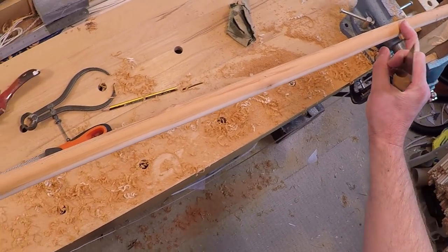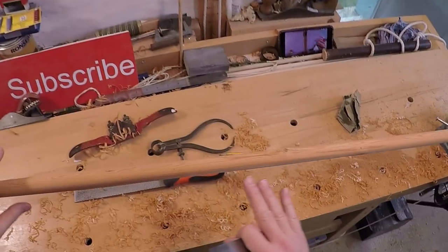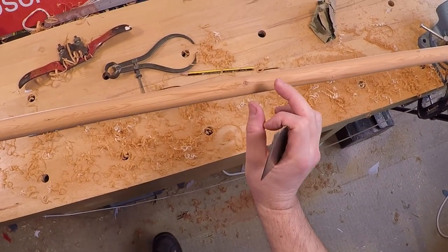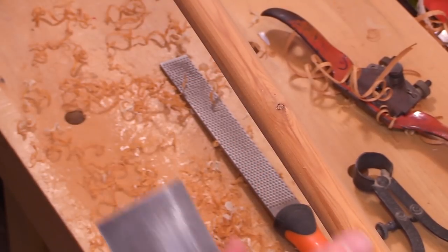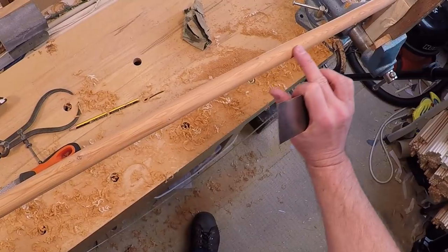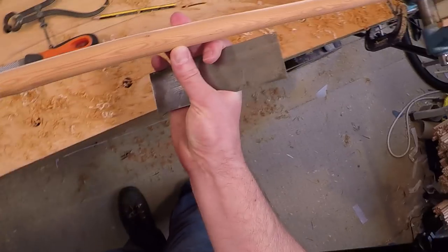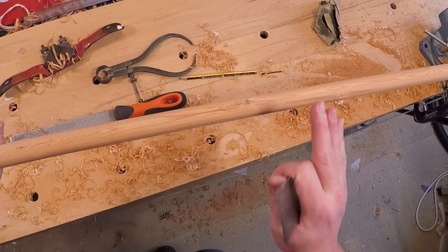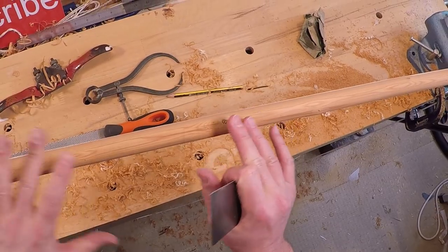throughout its length, so that it tapers evenly from the handle out to the tips, so that when we eventually put it up onto the tiller, hopefully the bend, the tiller of the bow, should be even throughout its limbs. It isn't a hard and fast rule. It isn't to say that if you get every single ring even, a nice single layer of rings, so you're not ending up with them bunching up like here, it doesn't necessarily mean that it's going to be tillered perfectly when you put it up onto the tiller, but there is a much better chance, and it gives you a visual clue as to where to take away wood